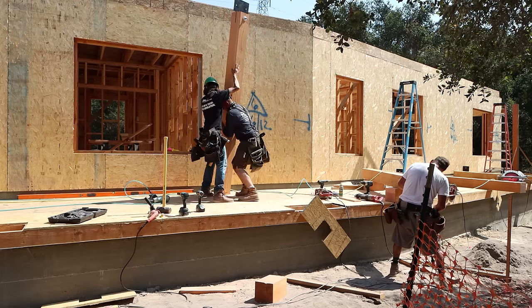It's not gonna show, but I don't like it. Flush here. It's held up right there. It'll only happen in the middle of your sheet, so you just have to watch when you put these things down. You almost have to nail the far side, nail the middle, and then nail the other side, which typically we don't do.